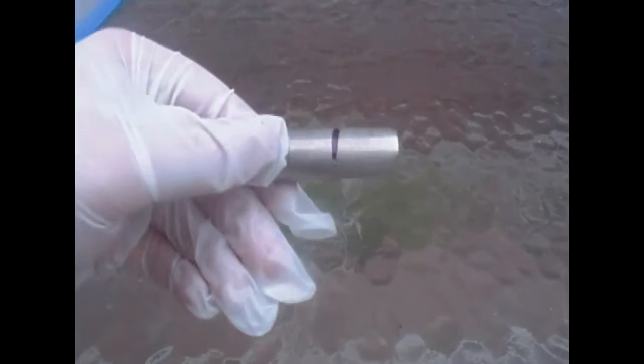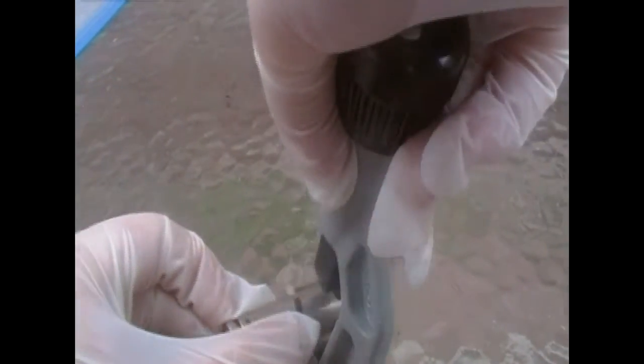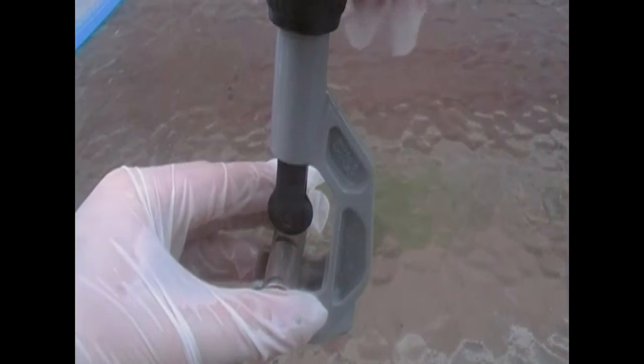Just as a safety reminder, gloves, protective eyewear, and protective clothing should be worn when attempting this. The battery contains acidic electrolyte, which can burn and possibly blind you. Another disclaimer I have is to warn you about the danger of tampering with the battery. When attempting this experiment, if there is a moment when the battery heats up suddenly, you've probably shorted out the battery. This shortage can result in the battery releasing excess electrolyte and possibly exploding. If this occurs, please move away from the battery and allow it to vent away from anyone.